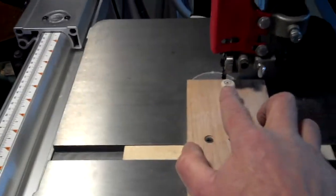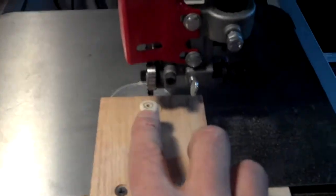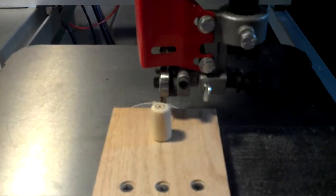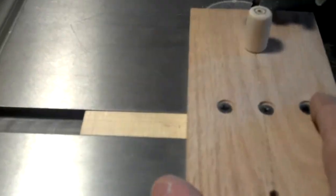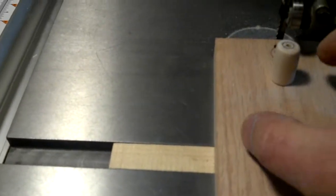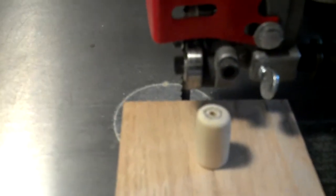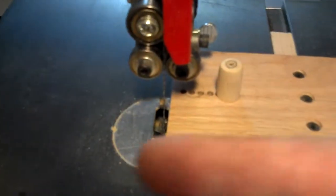There's a critical lineup that takes place where the center line here lines up with the saw blade. If it's too far back, when the wood is turned it pulls the blade this way. If it's too far to that side, then what happens is the blade wants to wander out that way.